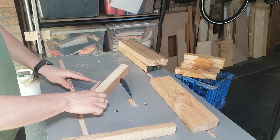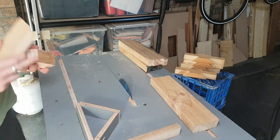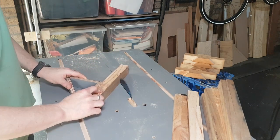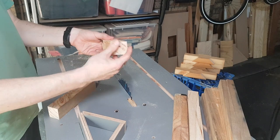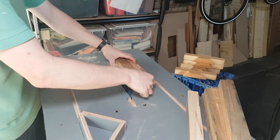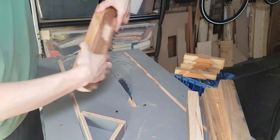And it was time for the really cheaty part. These are the bits where the mortises will be formed. Instead of clearing out the mortise, again operating right at the height limit of the table saw, I'm able to simply cut the center pieces at a 45-degree angle and then pull them apart. You'll see during assembly how this is going to make life easy. 45s straight through the guts.